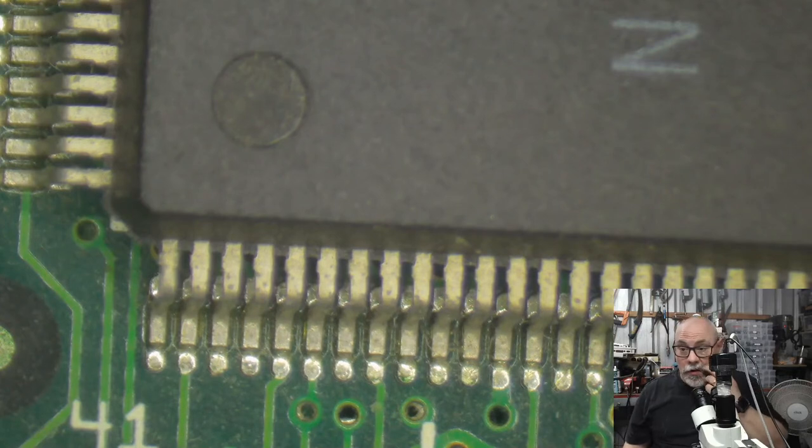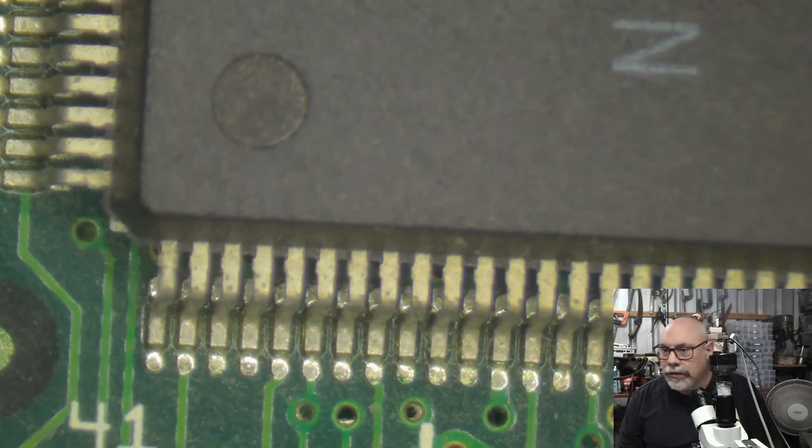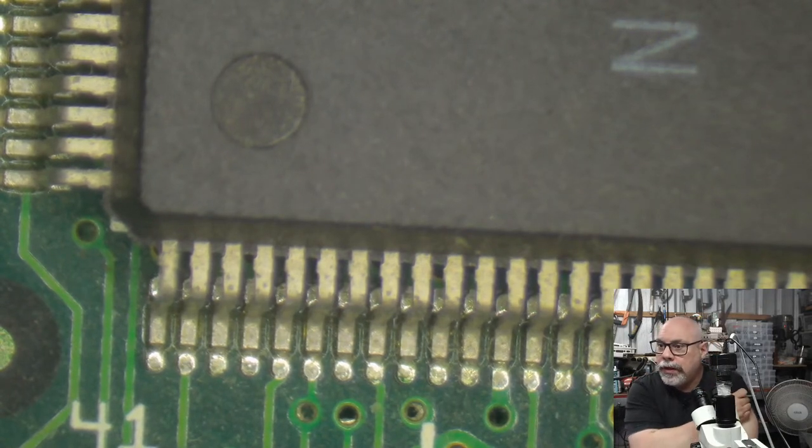I've never had that, so I'm afraid I'm not a great deal of help. But obviously, the first question I would always ask about a Color Classic is, has it been recapped? Because anything could potentially go wrong with those if they haven't had the caps replaced.